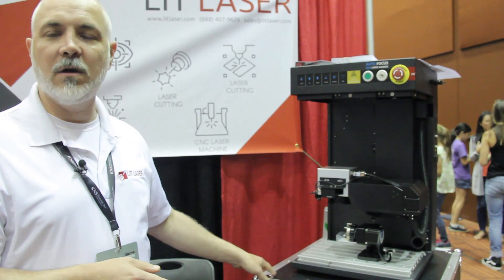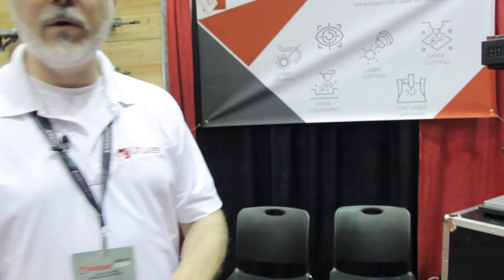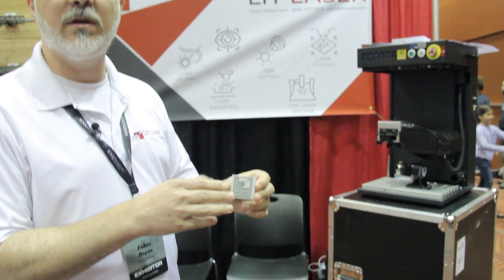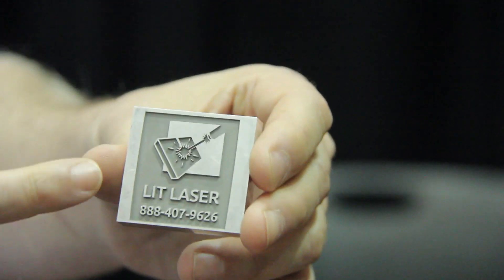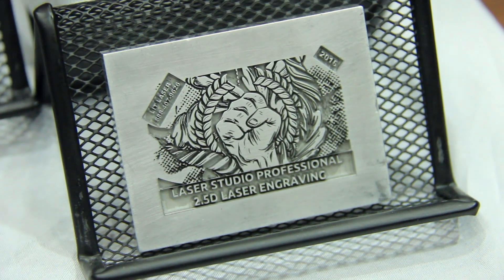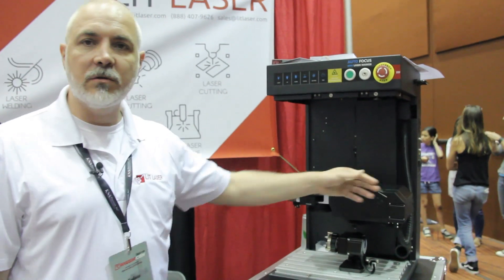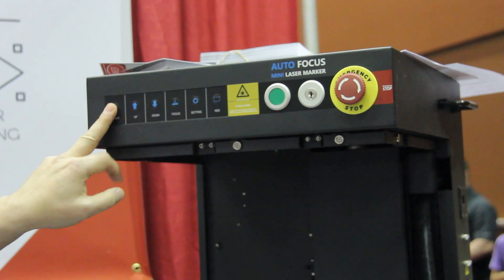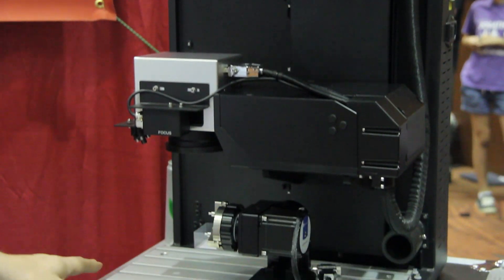The last machine we talked about was a 3D machine. This is a two-and-a-half-D process machine, so we're running the same pattern over and over again, and in between each etching we're stepping the z-axis slightly in order to maintain correct focus. There is no limitation to how deep you can go with the etching. Just like the other machine, it's fully enclosed with doors, a built-in light, and autofocus. We can also add an x and y axis to increase throughput.